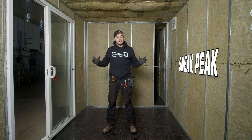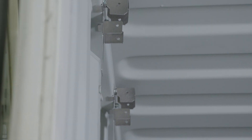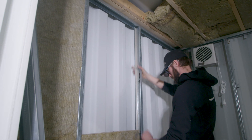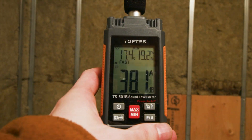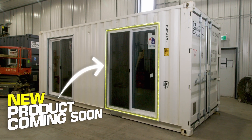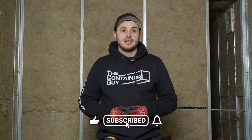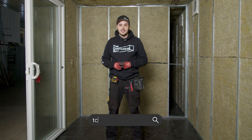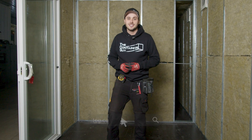This is a very cool method of framing shipping containers — here's what it looks like finished with wood stud brackets up top, wood studs across the ceiling, and steel studs going downwards. It creates a very soundproof envelope. Make sure you follow along, subscribe to the channel, and ring that bell for notifications. Check us out at tcg.ca — hope you learned something.